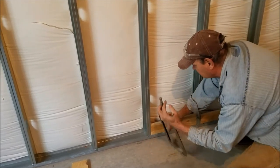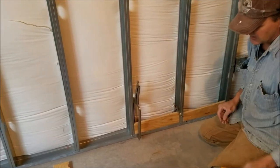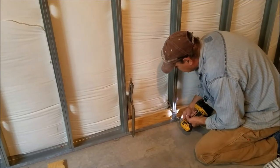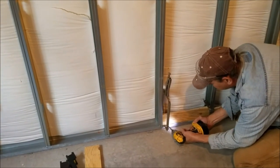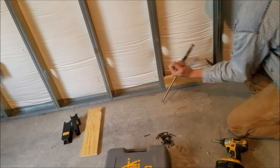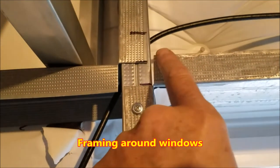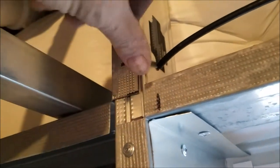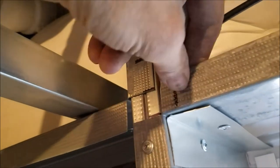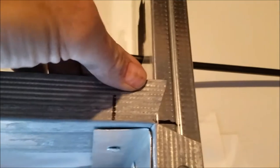I've got a huge clamp — you could probably use a different clamp. The reason we're going with such big backing is because we've got big trim. Put one screw in your stud and you can put one screw down towards your track but kind of hold it up high, just like that. Now traditionally people just hack it straight down, and then when you screw your sheetrock here it tends to push in the edge of the track like that, which makes it hard. But the way I did it — I did the other side right — so when you do push against it, it's pushing against the stud. This here pushes against the stud.